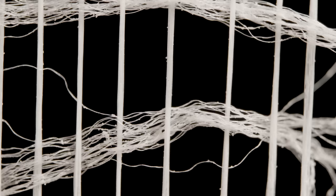And perpendicular to these fibers are bundles of very thin fibers. This loose weave helps to reduce the cost of manufacturing. It allows the adhesive to pass through the cloth and adhere to the backing, rather than requiring a layer of adhesive to affix the cloth to the backing and then another layer on top of the cloth.